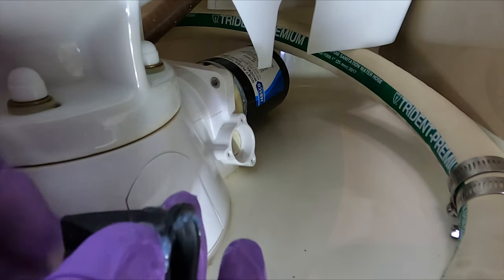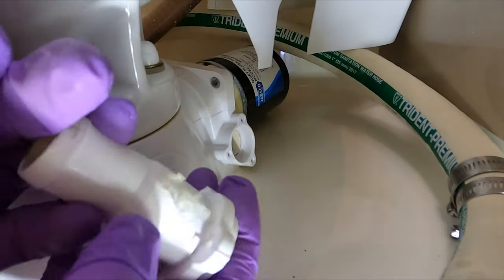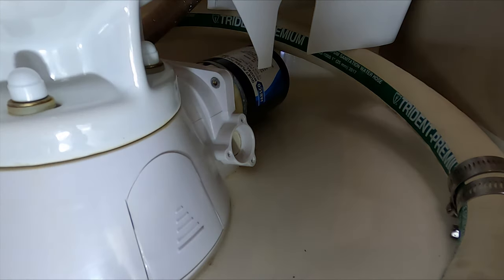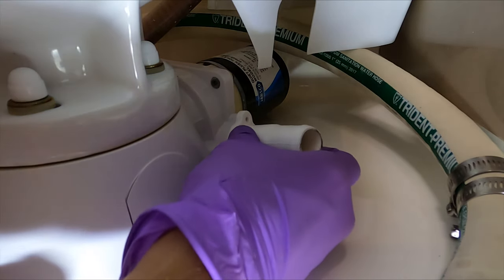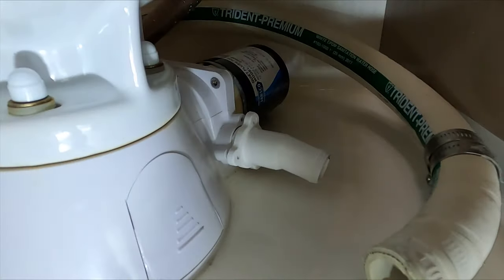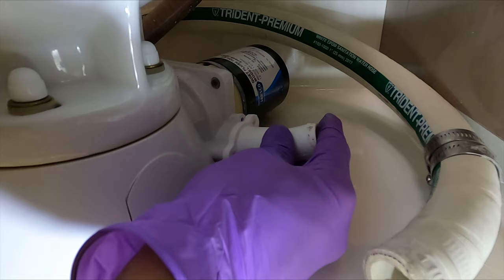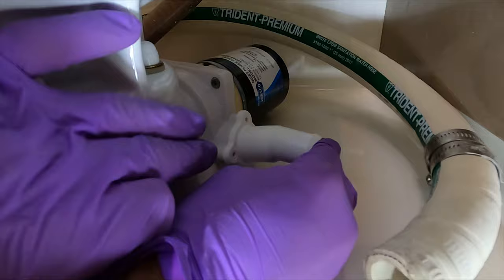You don't need a lot — just a little kiss, not a ton. See how this does not stick at all? Just peels right off. So this silicone is no good — silicone is not the correct use for this. We'll go ahead and put our joker valve in. That's the way I think it should go. This hose has a really tight bend. Since we've got a little bend on there, we can think about how we'd mount this — it will definitely go that way, so I guess it's got to go on like that.